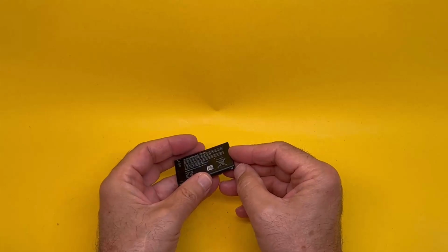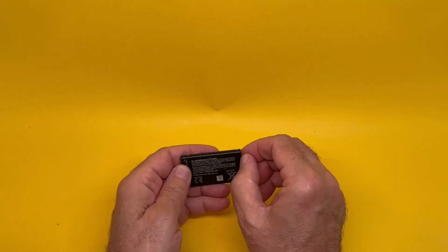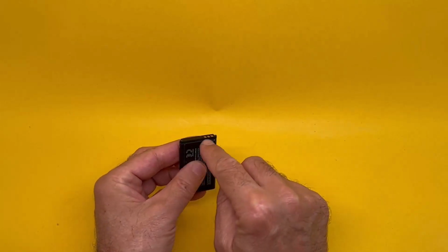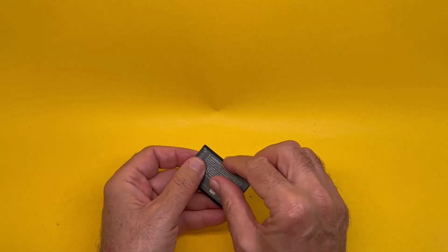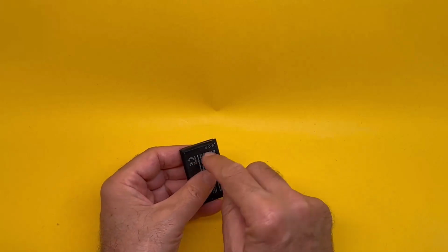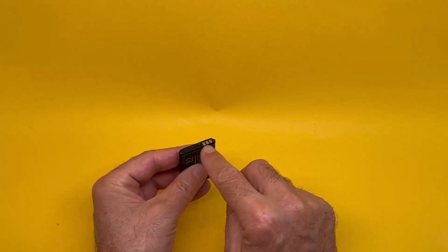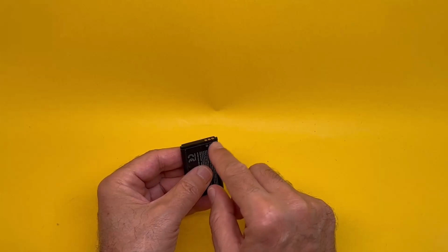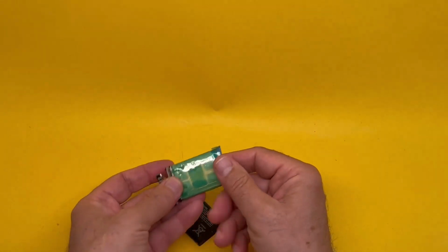Then use very fine pliers and a scalpel, and you begin to remove that casing, but don't touch the head of it where these contact points are. Don't touch that part. Just try to remove the rest of the plastic. You remove all of that and keep the end of it. You find that from the positive and negative there are two little cables coming out. The rest of it is something that might look like this.